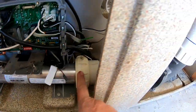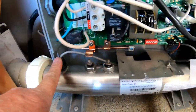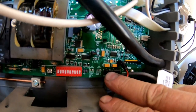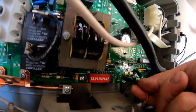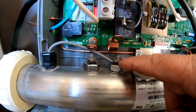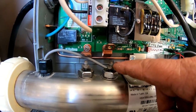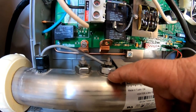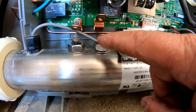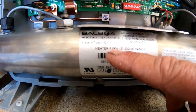I have this tight, this tight, and this tight — all sealed up. Next, plug in the sensors. You've got a sensor here and a sensor here. Run the wires underneath to get them out of the way. You've got two blocks — the one on the left goes to the sensor on the left. They just plug in. This heater has a 3/8 fitting on the bottom and 3/8 on the top. Always use a 3/8 wrench or needle nose to grab onto these so you don't twist them off — if you twist them off, you have to replace the heating element. The heater ohmed out to 15 ohms, which tells me it's a 4.0 kilowatt heater.